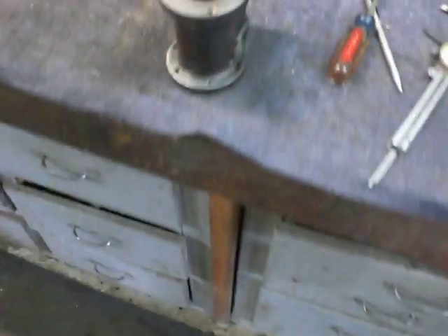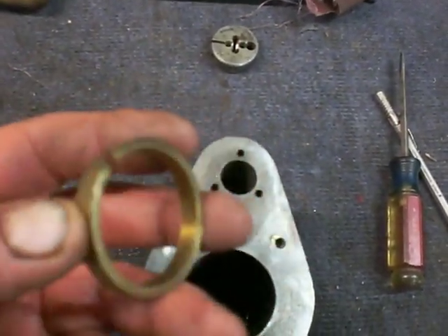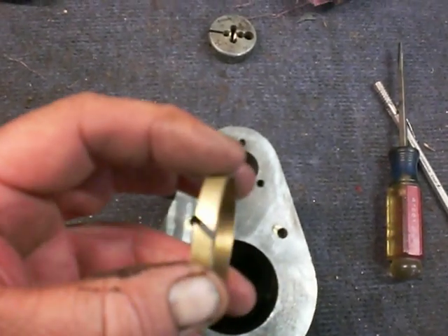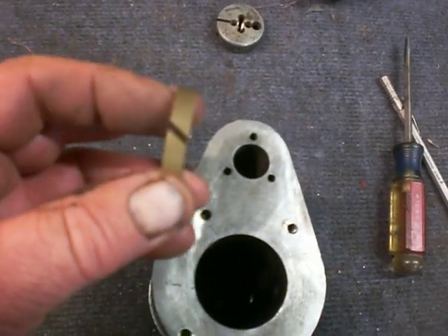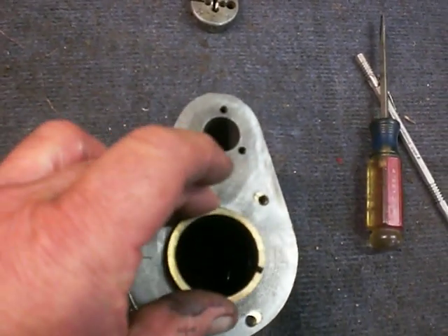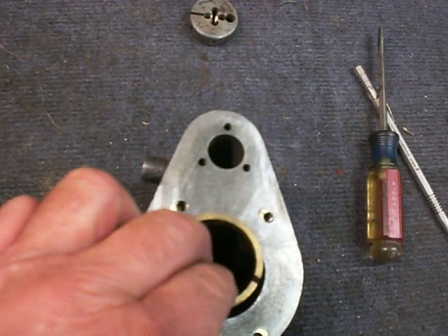Also, I want to remove the rings — there's two brass rings in there. They practically fell through the bore. So I believe I'll just very carefully spread that gap open a little bit so there's a little bit of tension, so the rings have a little bit of tension on the cylinder bore.